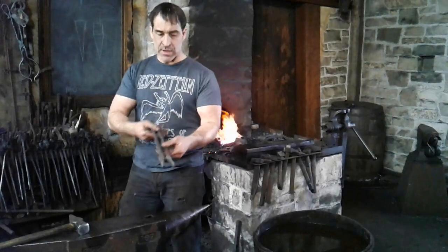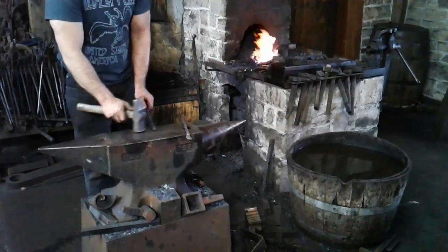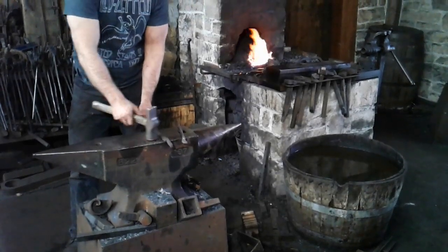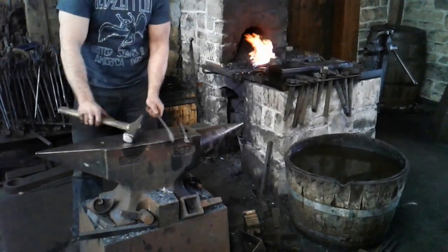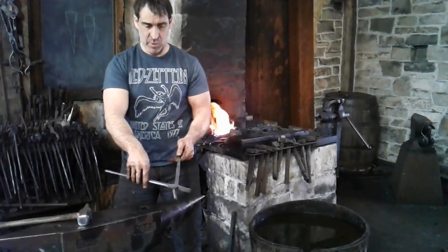You can see the way we have done this. We've got notch number one, which happened on the inside edge of the anvil. Notch number two was a quarter turn counterclockwise on the outside edge of the anvil, and notch number three was another quarter turn counterclockwise on the outside edge of the anvil, brought down to form these two structures that will mate together and become the working tongs.